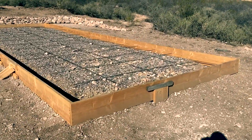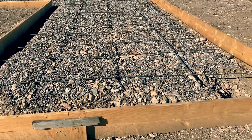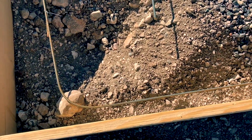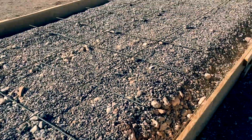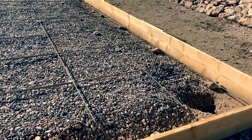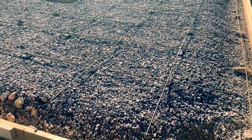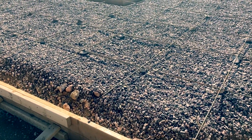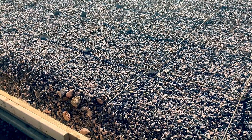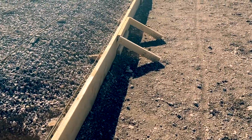After that I did the rebar grid — it's 3/8 inch rebar spaced about 2 feet apart, I just eyeballed it. I used 3/8 because it's really easy to handle and easy to bend. You can see in the corners where I had to bend it to a 90-degree turn — I just did that with my hands. I probably got more rocks and gravel in here than dirt, or at least 50/50, and there are a lot of benefits to that. The rocks and gravel provide good drainage, a really solid base, and create a lot of capillary breaks, which is going to stop water from being wicked up into the concrete. They're also going to add a little extra thermal mass to the foundation, which certainly isn't going to hurt.